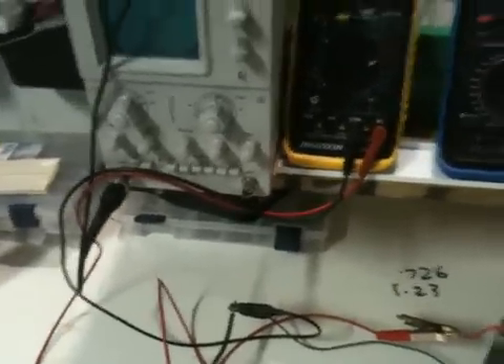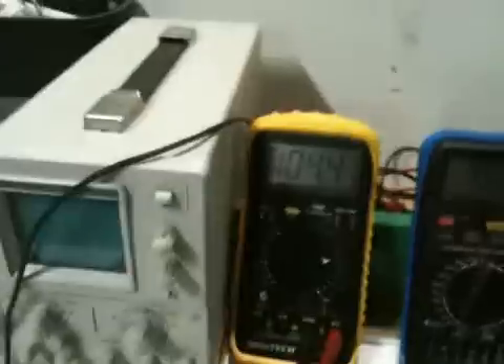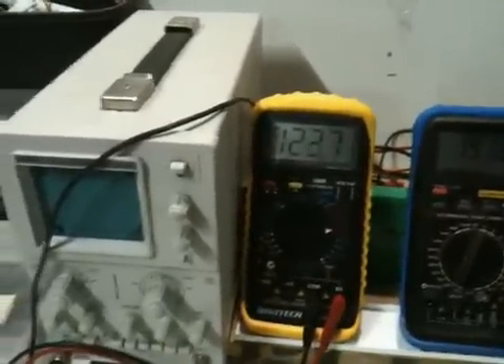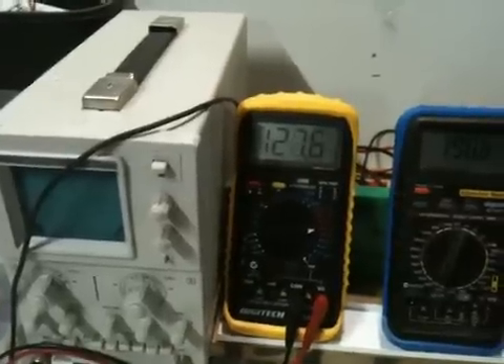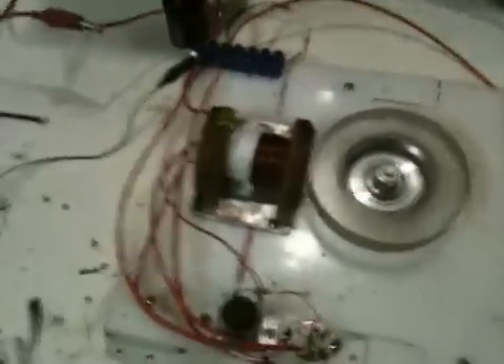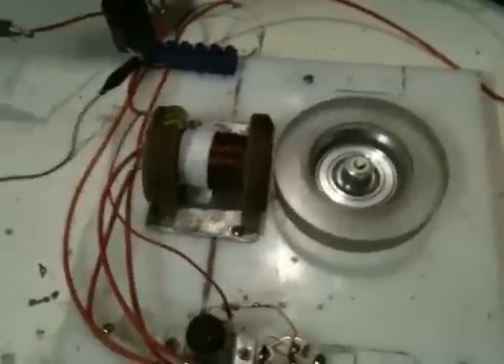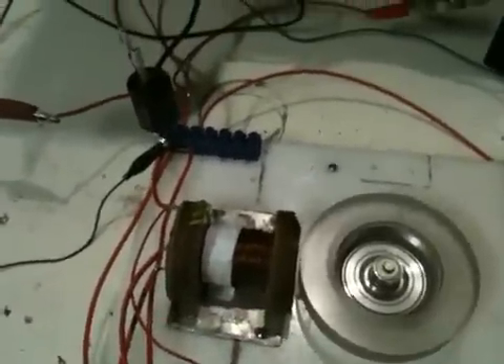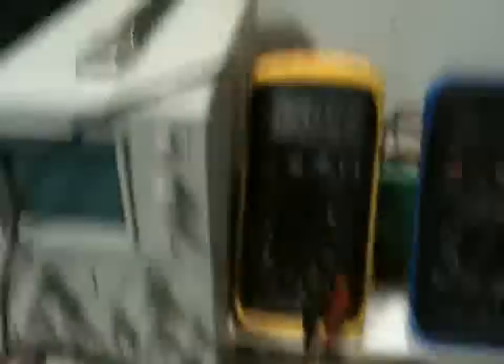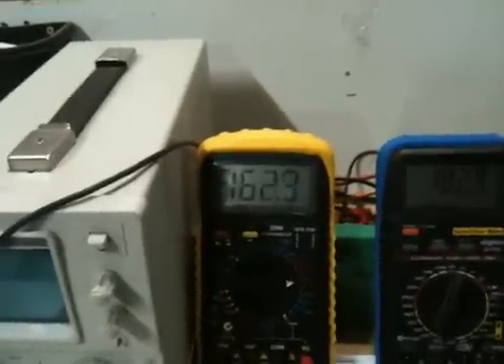Just so you can see how much the spike has gone up, I'll disconnect the globe — I'm going to punish the transistor a bit but it should be alright. 110, 120 — up and up. As you can hear, because there's no load, the cap's a 450-volt cap. The motor's speeding up as they normally do when you disconnect the high voltage wire from a load. 159, 160 — still climbing.